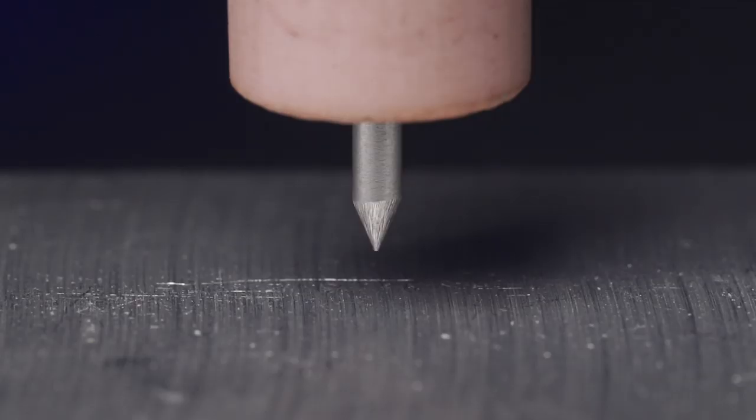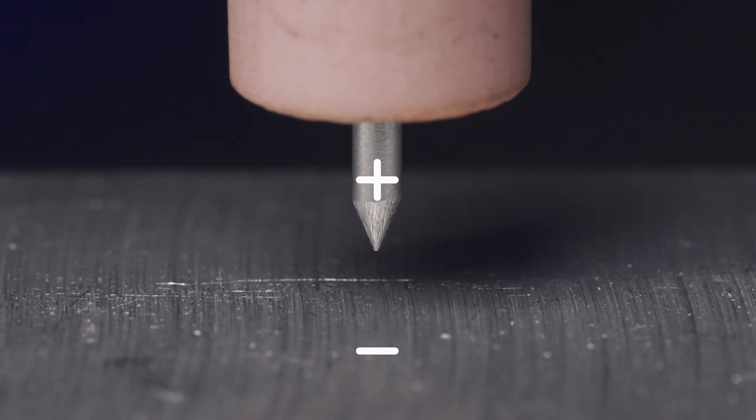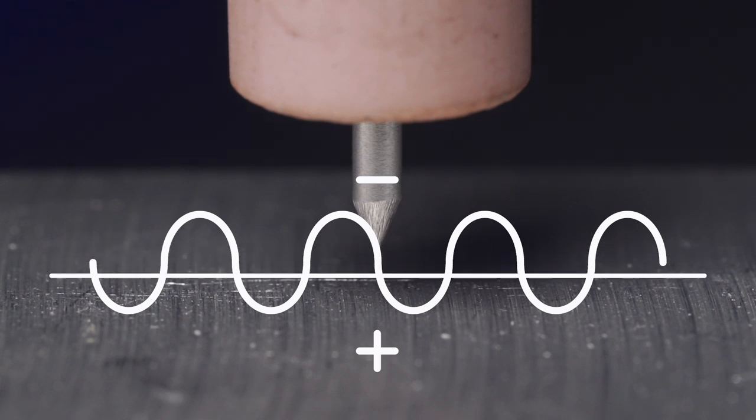A quick explanation of what's actually happening here. AC stands for alternating current, which means it's switching back and forth constantly between positive and negative. Positive in this case means electrode positive, so on a portion of the cycle the current actually flows from the workpiece to the electrode — this blasts off surface oxides off the part, and that's why they call it cleaning. On negative, the current flows from the electrode to the work, and that's the penetrating side. Wherever the current's ending up is going to be hotter. The AC balance adjusts the percentage of time spent either on the positive or the negative side.